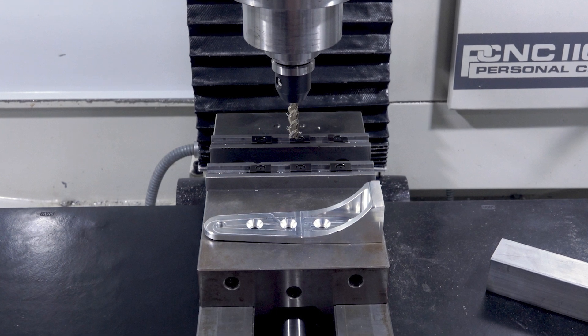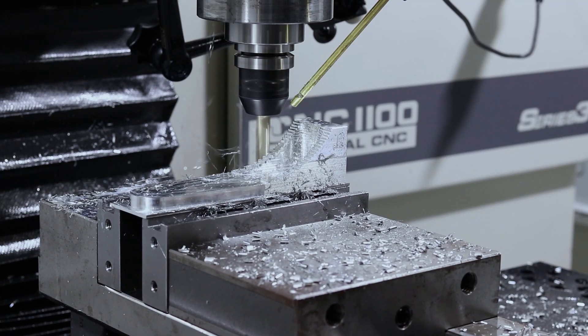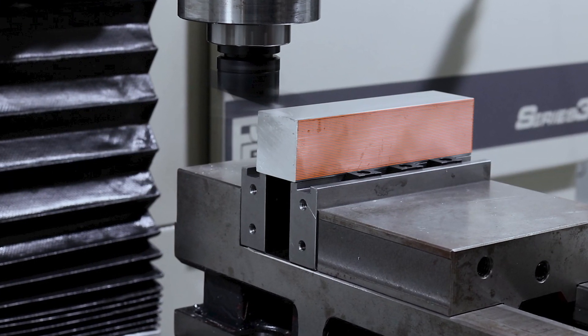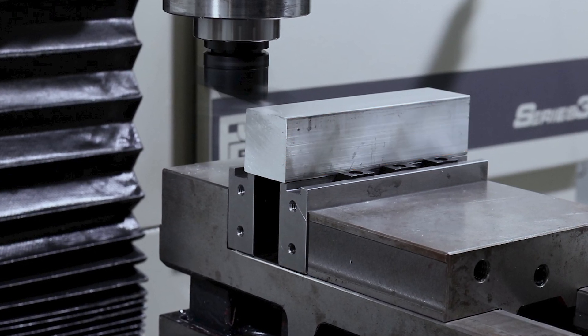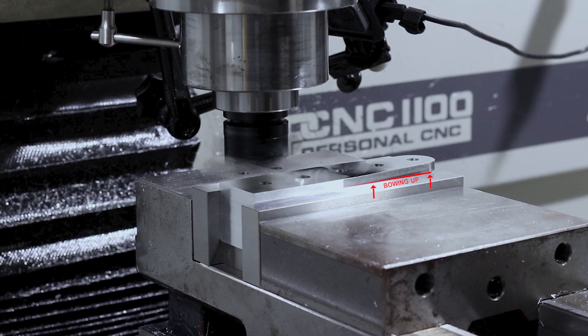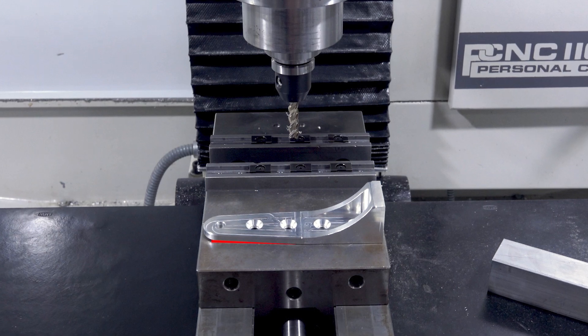Back to the mosquito part — we learned one really important lesson. This material is an extrusion, and most aluminum we come across is extrusion. You can actually see the extrusion lines along the x-axis of the part, which means there's some tension or stress in the material. In this case 6061 aluminum doesn't have as much stress as cold-rolled steel, but there is some. The lesson we learned: when the part was all said and done, we flipped it over and decked the backside using traditional vise jaws, and the part had curved or bowed on us. Solutions include sending material out to be de-stressed, removing equal amounts of material on both sides, or cutting away the bottom plane, leaving material to accommodate flex, reclamping in a stress-free state, and then re-decking the material.